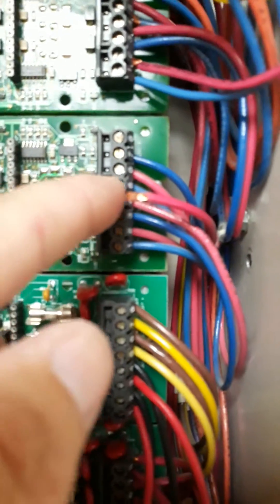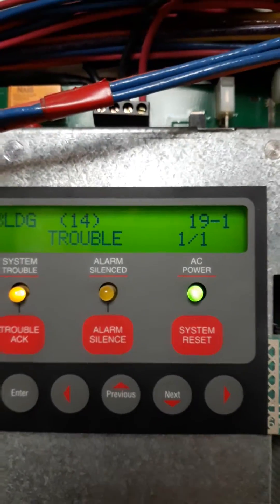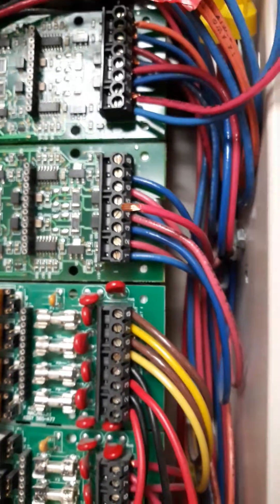I just disconnected one leg of it before I started messing with it. I made sure it came up with the right trouble first — it does. I want to disconnect it, and then I checked voltage on the actual base before I started messing with the wiring, because I don't want to accidentally dump a hotel alarm in the morning.